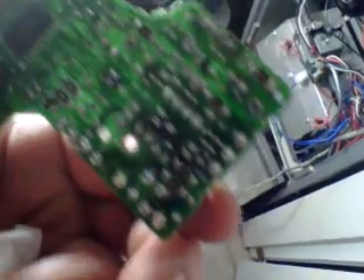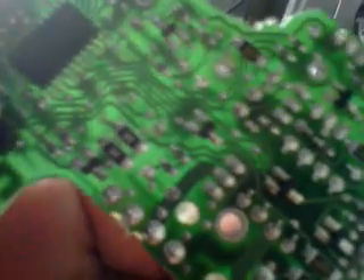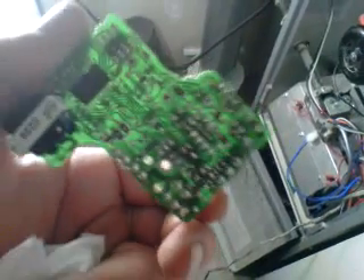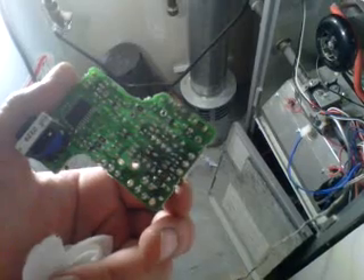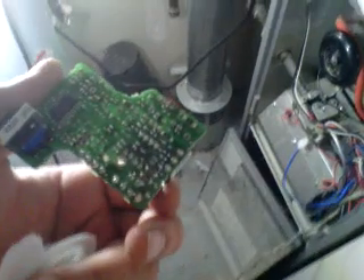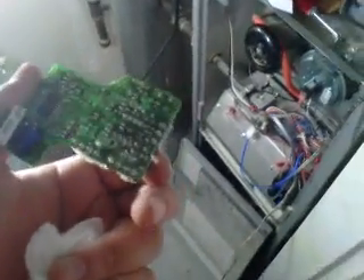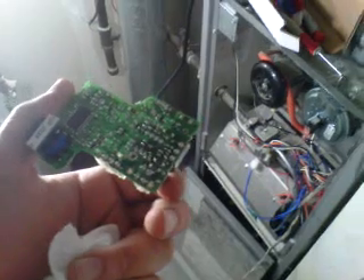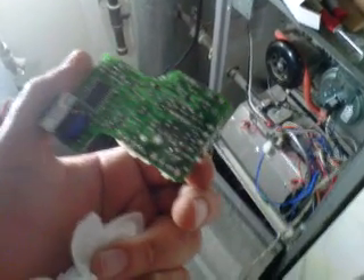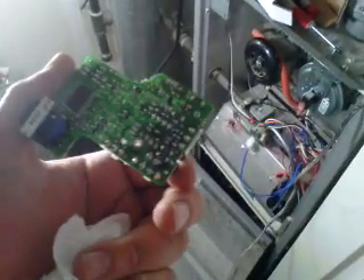Surface mount is a whole other ball of wax. When I say surface mount, I mean all those little guys that are attached directly to the board — they don't actually go through the board. So what I'm going to attack is the through-hole devices and the larger legs. Just with my electronic eye I can see there are a lot of points that don't have enough solder flow onto them. Because of the different cooling rate factors of the larger pins and the actual board, what you get is micro-fracturing — basically a loss of connection between your devices on the board.